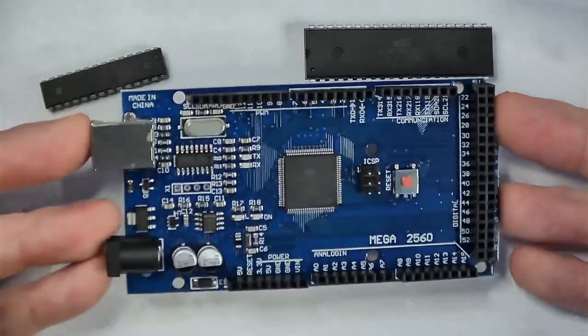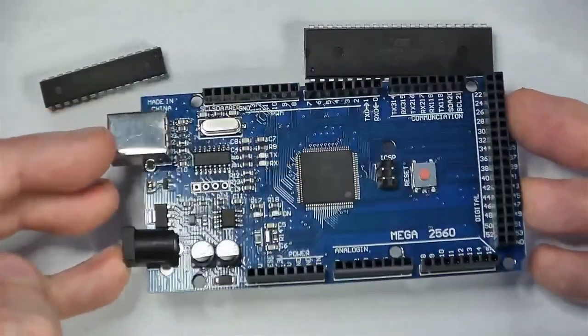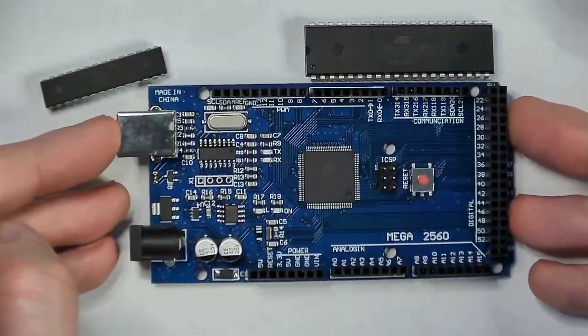Hence I decided to stay with the AVR 8-bit architecture, as it offers the best compatibility with this build of Tiny Basic. To be honest, other than the RAM and some speed increases, there is very little advantage to using 32-bit microcontrollers over 8-bit AVR for this purpose.